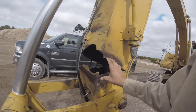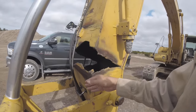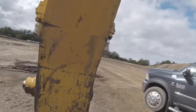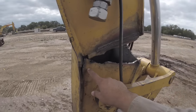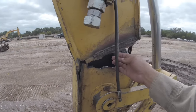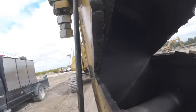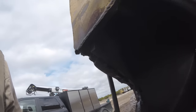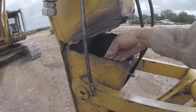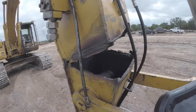And then I'll tack it in place and then start replacing panels front, back. Then the sides up to about this point here, I'll make a cut, nice clean cut, because here where it transitions to a thicker piece, there's a backer plate in here somewhere, right there, the backer plate in there, and up in here. So I just cut this line nice and straight, put another backer plate as I put this piece on here. Hopefully that will give me some good penetration there.